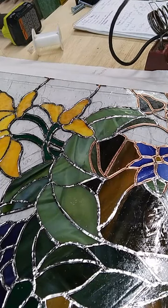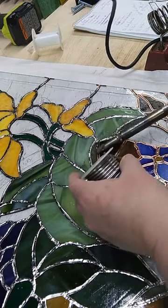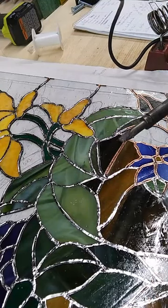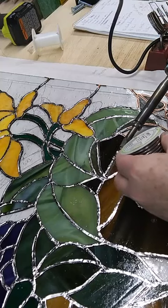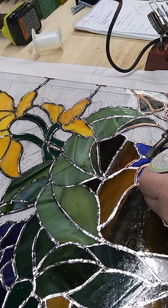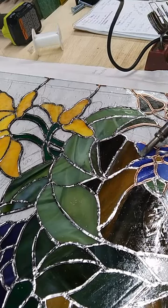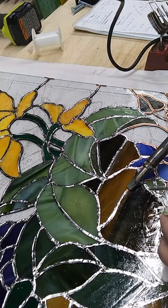Right now I'm on the back side and I'm doing a flat solder. I'm using a Weller iron. It's not my favorite, not my preferred go-to. I had just bought a new Choice iron. That's my preferred go-to, which uses a rheostat, because you'll see when I start finish soldering, I go really fast. And that one will keep up with me. Actually, sometimes I use two of them simultaneously because one won't keep up. But right now I've got an 800-degree tip in it. This Weller iron is the old style that controls all of the heat by the tip itself in the iron. So I'm kind of at its mercy. I can only go as fast as it will let me. I can't push it like I can the Choice.